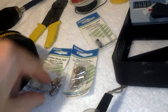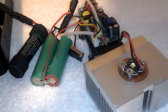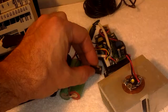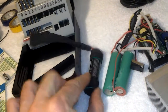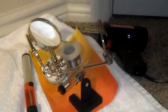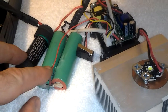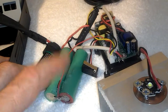You pick your bit, same sizes, whichever one you decide on using, and pick up one of those battery operated lanterns from like the Walmart automotive department. They're like $50. I just left it connected because I was messing with the light. But these are the same sizes. This is the battery that's actually in the Onyx, the original battery. I think they went cheap on it, and that's why I had to replace it, honestly, because the good ones are black. But you take these batteries apart, get your solder tools out, and if you have 2 of the Onyx Studio 3s, you can just double the capacity of both of them right off the bat, and these are easy to hide away in the sides.